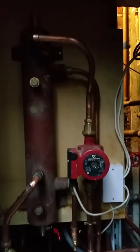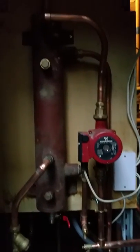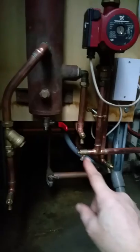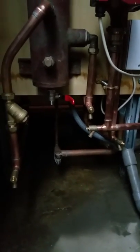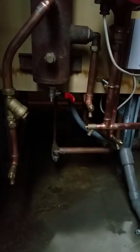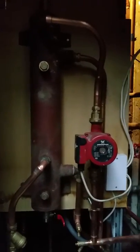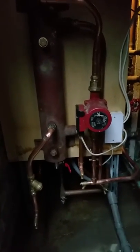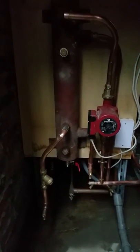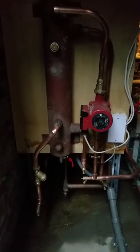This is now nice and easy to service — you get to everything. The isolation valves work really well, so I'm not bothered with isolating pump valves; just use pump unions. I've got drain points everywhere, as you can see, so everything's easy to drain down. I still haven't got hold of any of the newer drain cocks that we like on the forum, so still using those old things. Weather comp — I personally would put weather comp on this, but the customer's moving and it costs quite a lot of money to get the kit. It's an old retro kit anyway and these controls aren't the current controls. A lot of the stress and strain on these boilers has been due to the fact it wasn't weather comped, and the boilers are just running flat out, switching on and off all the time and cycling, which doesn't do them any favours at all.